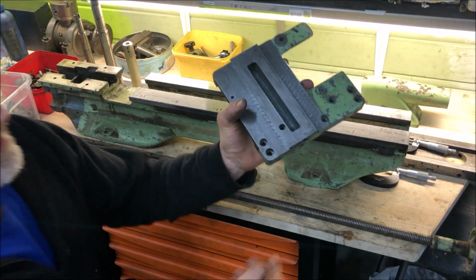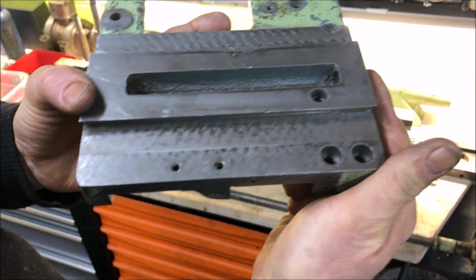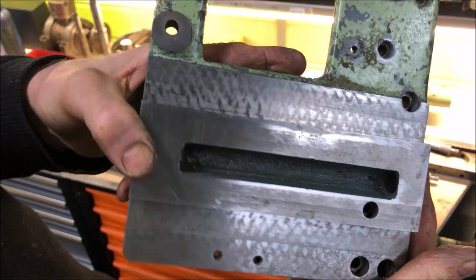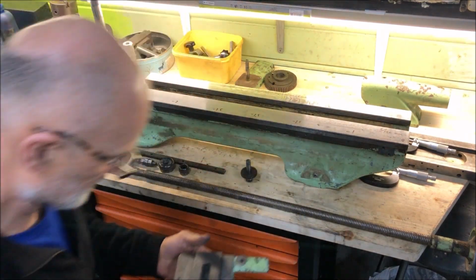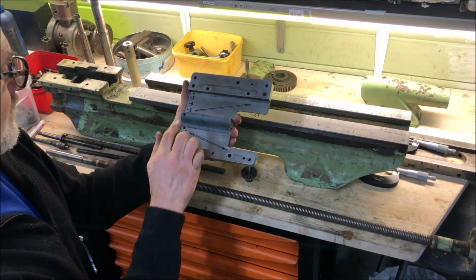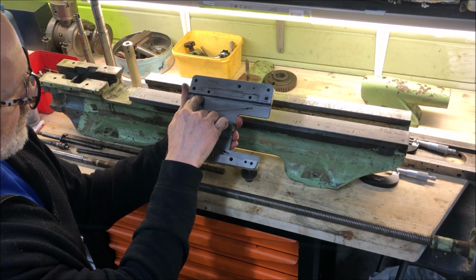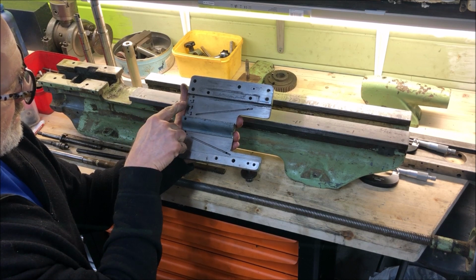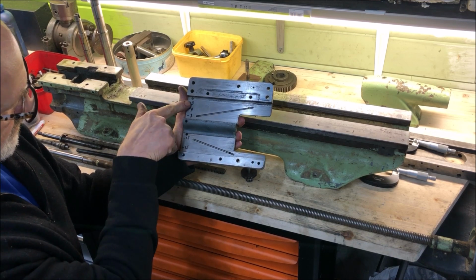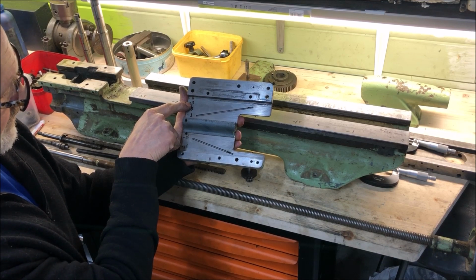As you can see here from the saddle, it's hardly worn. You can still see the scraping marks all over, which I have measured also and found that it is quite normal wear, not so much, indicated between the untouched area over here, set 0, and then finding that it's -3, 3, 2, 1.5, 1.5. So -3 at the highest, sorry, the most wear there.